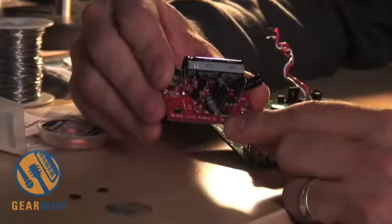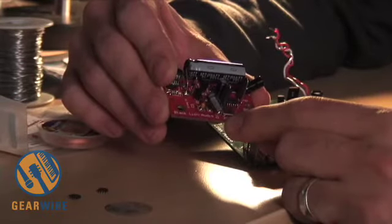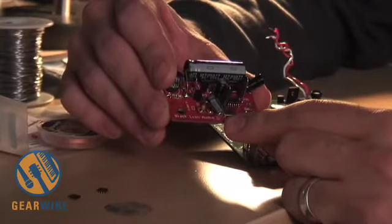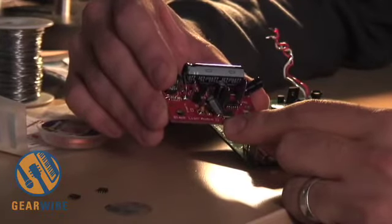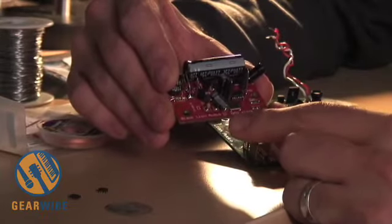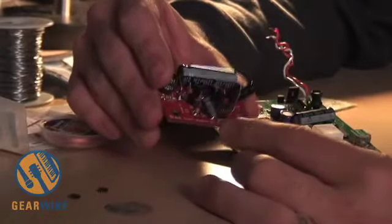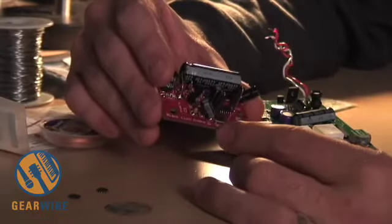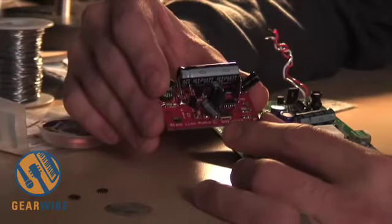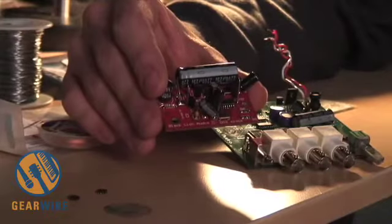So these are crystal oscillators. They're manufactured for us specifically for audio frequencies. You have to get them custom made. We order them from a company here in the U.S. who typically makes crystals for aerospace applications like NASA. They're based in Florida. And we found that by far these are the best sounding crystals. They have the lowest intrinsic jitter, which is just jitter that's inherently there in the crystal.